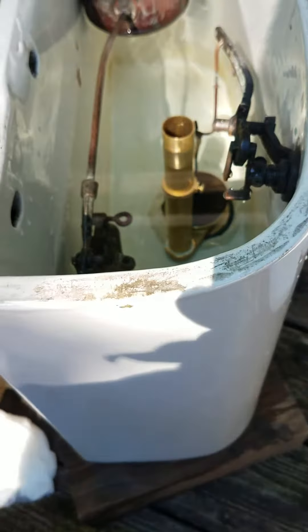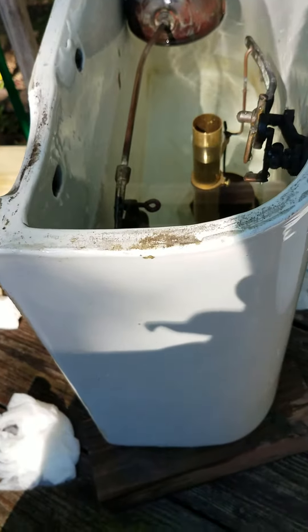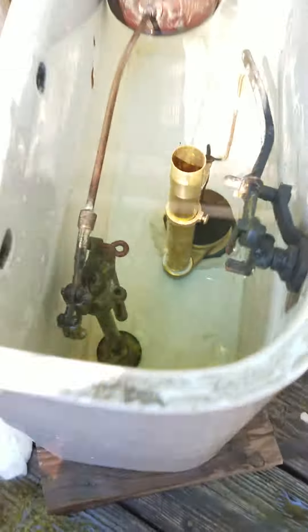You can actually clearly see the warp in the tank from under here. You can see a gap between the nut and the tank — that's because the tank is warped on the bottom. I had to put plumber's putty around the seal to get it to seal. But anyway, everything's coming together well. I'm supposed to get the flush elbow on Monday; the original flush elbow is damaged so it's not going to work.